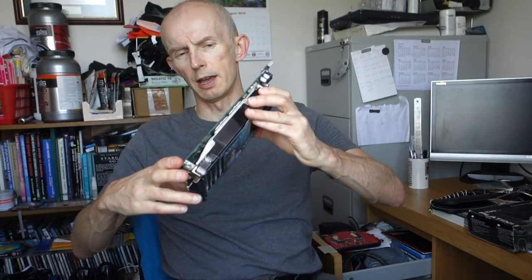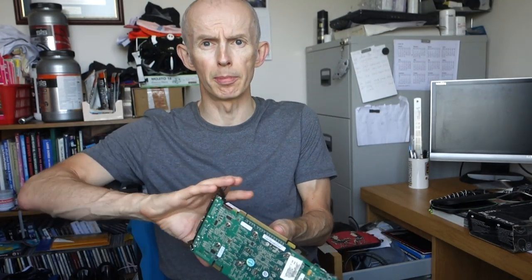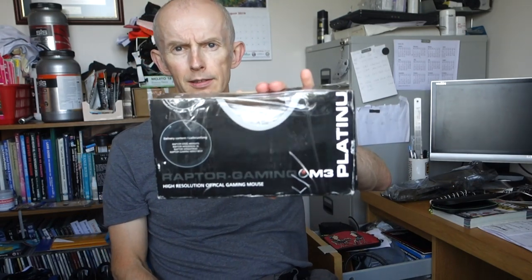I had a piece of computer equipment at work that's 10–11 years old and it stopped working. Everybody just wants to sell me a new one — they're like £40,000, ridiculously expensive. It's a control unit for a milling unit. So I took it apart and found a blown capacitor on the motherboard, ordered a replacement capacitor and changed it. It had also blown the video card — that's the graphics card that came out of it, it's bust and won't respond. I've deduced that by putting a basic graphics card in to get it turning on and recover data. I've now ordered a second-hand similar graphics card, and here it is — I'm going to leave it in the bubble wrap to protect it.